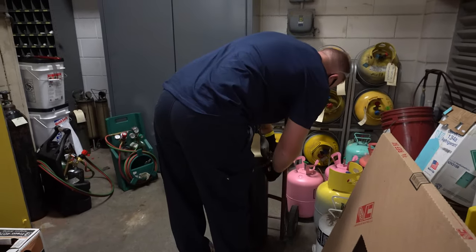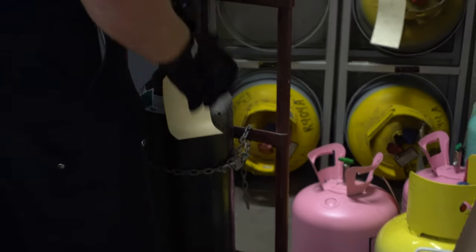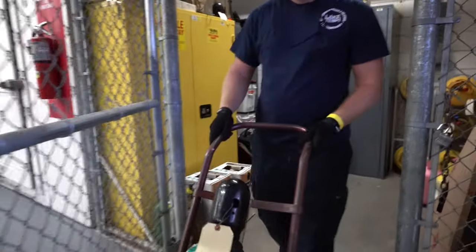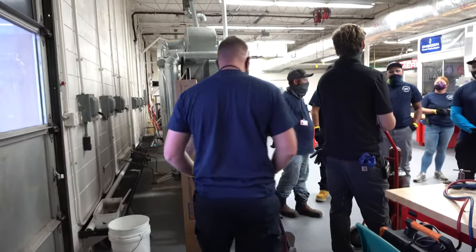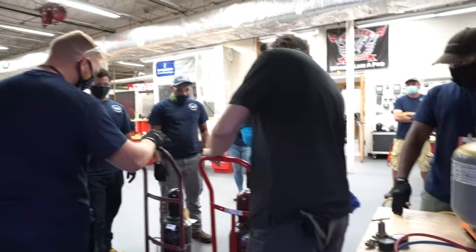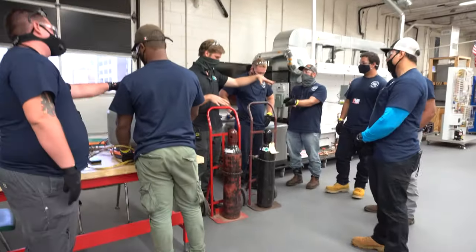Big or small nitrogen tanks, it's around 2,500 psi pretty typical. Why? A bigger tank has more volume but not necessarily more pressure. You might pressurize four systems with a small tank and twenty systems with the large one — both at 2,500 psi when they first come out.